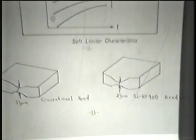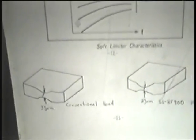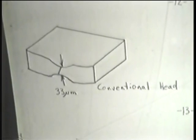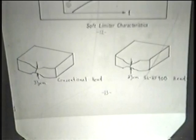And the 2 main heads, the A-B heads, assuming it was just a 2-head drum, shows you that the thickness of the 900 is less than the conventional head. In other words, the width or height or thickness or whatever you want to call it. It's a narrower head, and the reason they want to do that on the normal head is so, well, according to this, that it leaves a little bit of a guard band, which isn't a good term, because there is no guard band, as we know. That's just in the 900 though, Joe. Yeah. Just the 900.